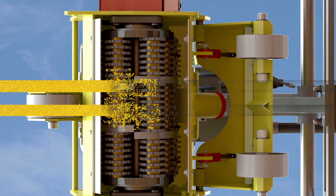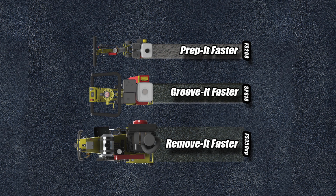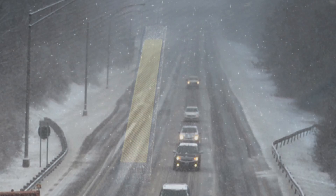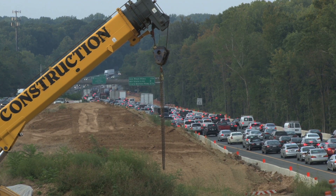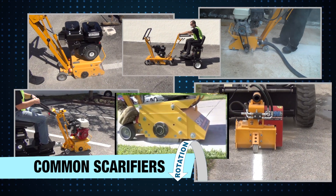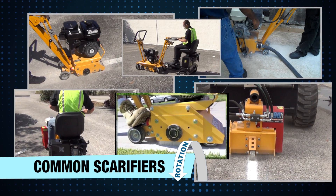The scarifier does have a place in FDOT projects. The best scarifier uses are for jobs requiring removal of flaking paint and surface preparation prior to permanent striping. In snow country, a scarifier with sharp-edged grooving is ideal for recessing stripes below the plow line. And on projects where the surface will be repaved, the scarifier is a perfect choice to remove material faster, leaving a textured profile best preceding the asphalt overlayment material. Here is a variety of scarifiers used by contractors and maintenance operators that you will see on various FDOT jobs.